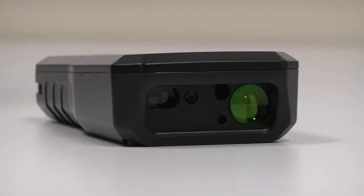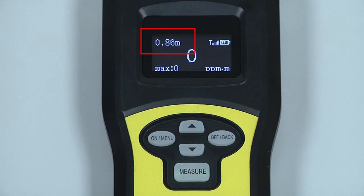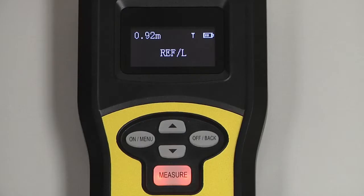The LZ30 is equipped with a distance detection laser, allowing the operator to know exactly how far away the target is, as well as aid with leak investigations through windows. The LZ30 features built-in warnings to alert the operator if the reflective signal is too weak or too strong.